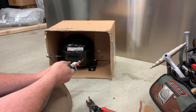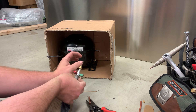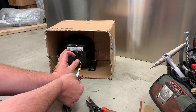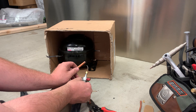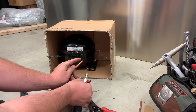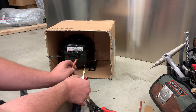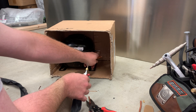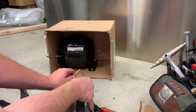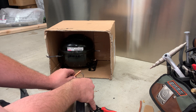When you first start heating this joint up with oxyacetylene, one thing to keep in mind is heat control. With these torches, you can adjust the flame length and the intensity via the mix of oxygen to acetylene. But I find more useful is position - you can bring the torch tip in close for real intense heat, and as you back it up you'll get less heat on that tube. At first when you're bringing the whole thing up to temp, you kind of want it closer in. Once you start seeing signs that the braze is melting, you want to back it off a little bit, otherwise you run the risk of overheating one side and starting the tubing melting.